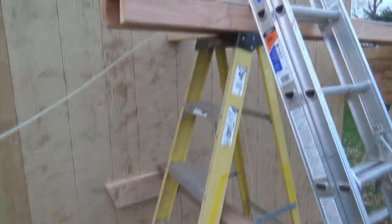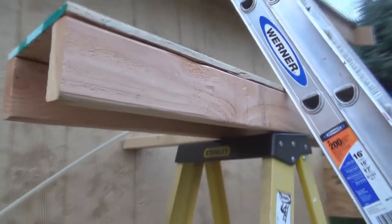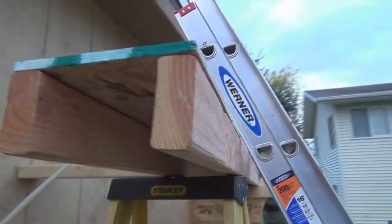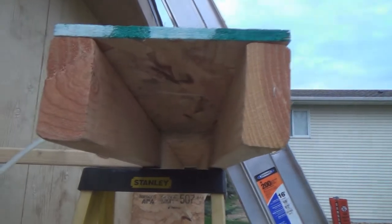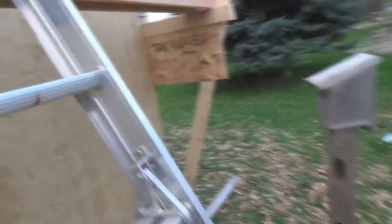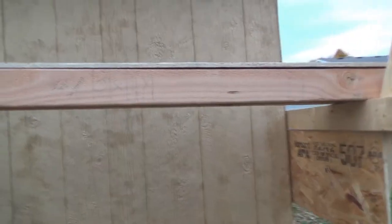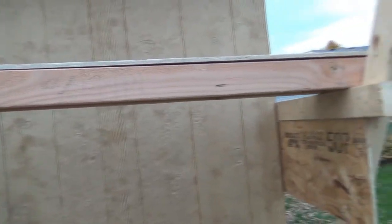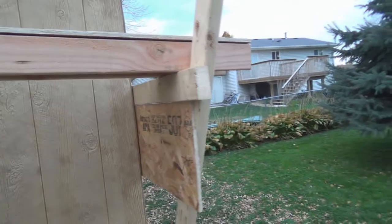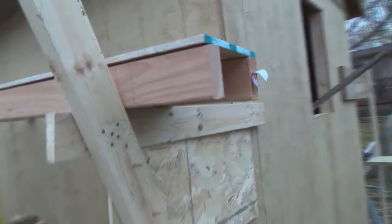My plank is a homemade deal that will come apart quite easily — it's just two eight-foot two-by-fours with a piece of OSB tacked on top, only three nails on each side. It's plenty stiff enough, only being eight feet long. The two-by-four carries my weight — 190 pounds — with no problem on edge like that. Now I can take it apart, and these will end up being shelving brackets inside the shed.